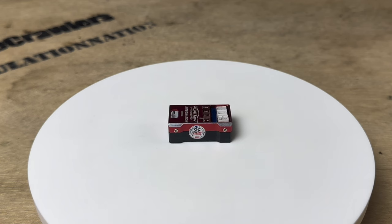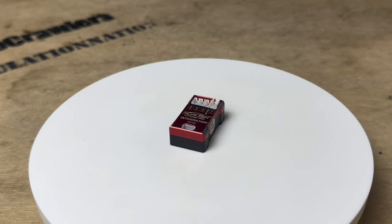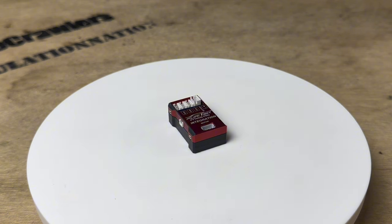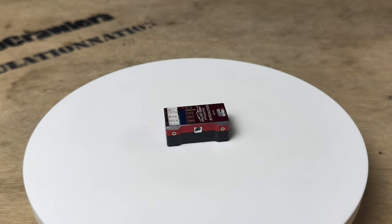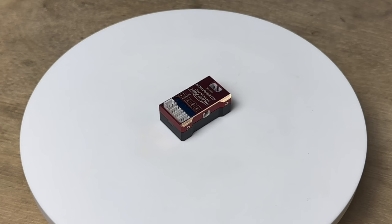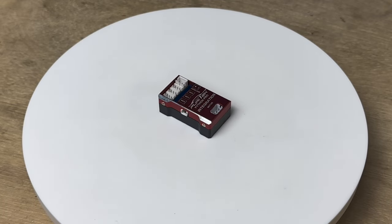This has the same 5-amp BEC capable of up to 8.4 volts. These are powerful ESCs capable of running 10th scale servos without hardly any brownouts. In addition to the power output, it has that buttery smooth operation we've come to know and love from FuryTech. It also has Bluetooth integration that hooks up seamlessly via Bluetooth to the FuryCar app, opening up a whole world of tuning and telemetry so you can really fine-tune your build.